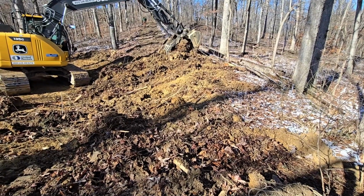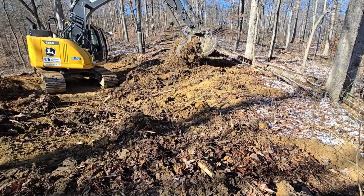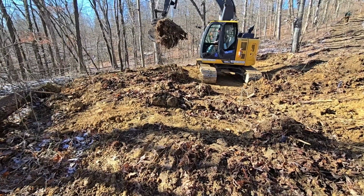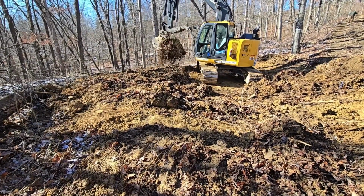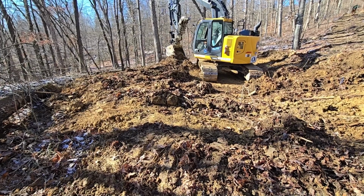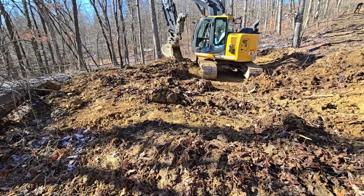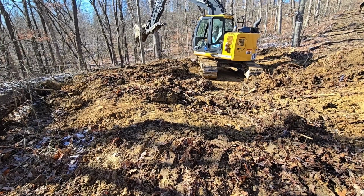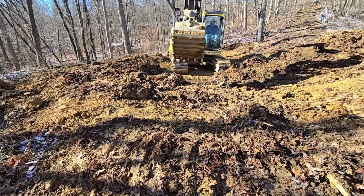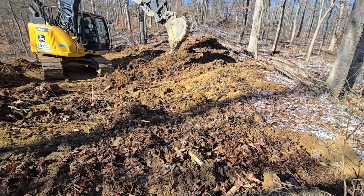John places the topsoil and the organic material that was saved in the wetland that we've lined with clay that's been compacted in layers to a total thickness of 24 inches. The topsoil and organic material are not spread evenly, but they're placed in naturally appearing ridges and mounds. He removes the piled soil along the upper edge so that runoff can enter the finished wetland. The rough and loosen technique is not used to loosen compacted clay in the basin, as this would create pathways for water to soak into the ground, and the wetland would not hold water.